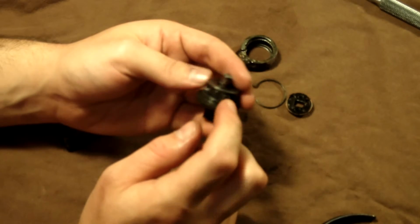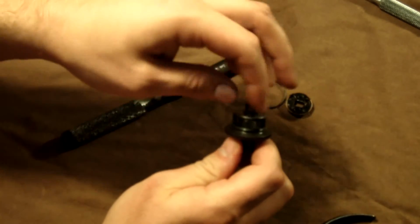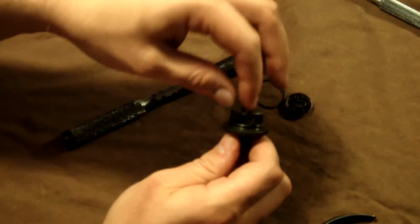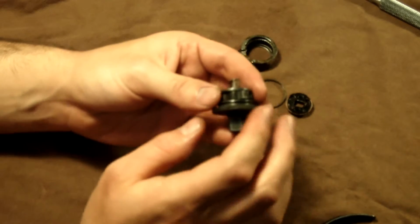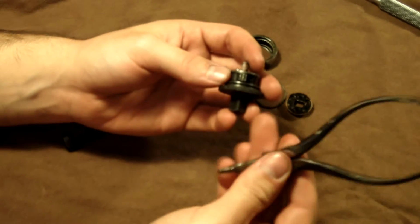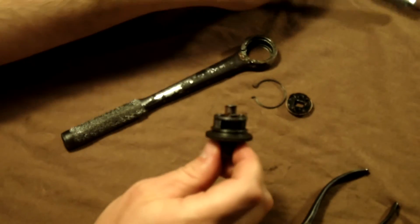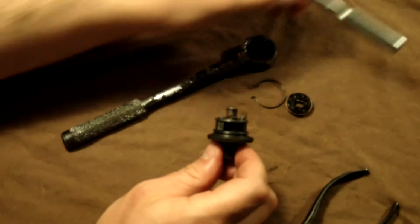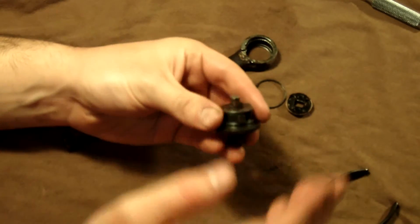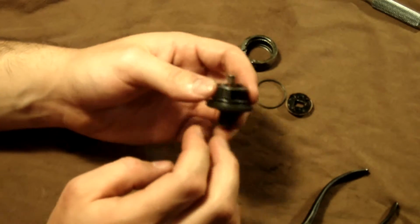So when you've got the spring in there and you're ready to assemble this side, put in the pin that this pawl is going to be pivoting on, not all the way down. Then you put the pawl in place, and take the other ball on the very tip of your needle nose. It's extremely small. You have no idea how small that is on the 1/4 inch, which was ridiculous. But after I learned this trick, it went real easy when I redid the 1/4 versus the 3/8 that I've messed with for I don't know how long.